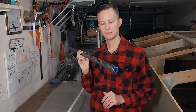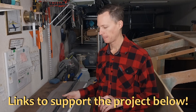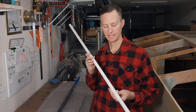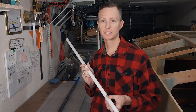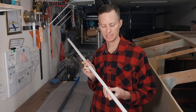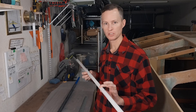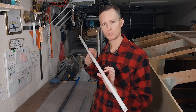This may have another purpose — I don't want to waste it, I'll just try and think of what I can use it for. The material I'm going to be using today is a PVC pipe and I have scratched it up with 60 grit sandpaper. This isn't compatible with epoxy; the two don't really stick together well, but it doesn't matter much. This is more of just the mold and it's an inert material, so it doesn't matter if it stays in there permanently. This is what I'm going to use to wrap up the carbon fiber.